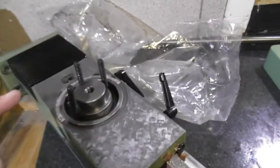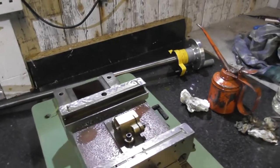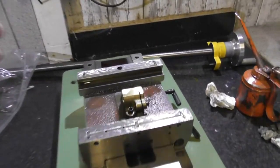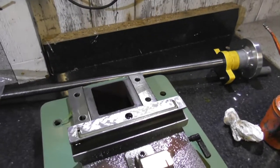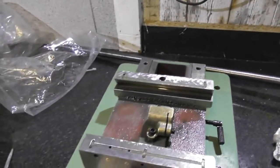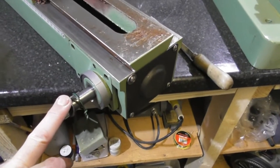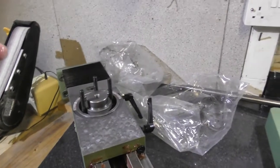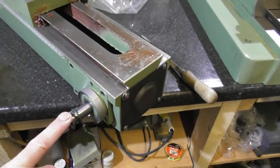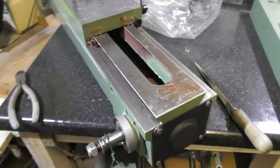Don't try and take it off while it's attached to the base plate — just take it off all in one and ease it back, because it just slides off the back there. I put some rag and muslin over the back of it so I wouldn't mark the paint or damage this edge. So yeah, it came apart very easily. Also, before you take it apart — before you undo the four bolts — take this wheel off here. Because if it goes down a bit heavy, it's going to hit the wheel and probably bend it or damage it.